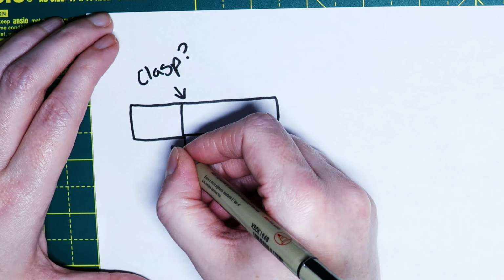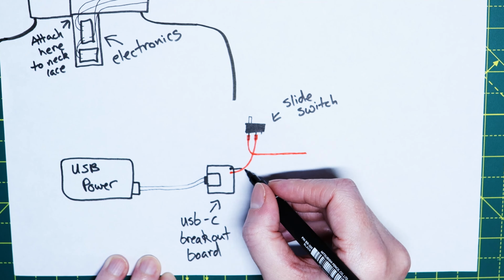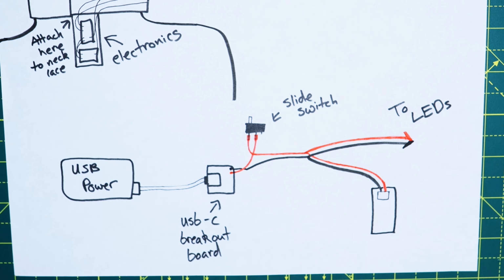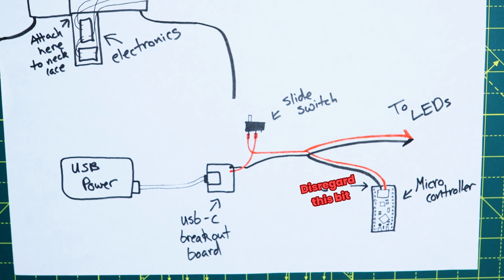I planned to put the microcontroller for the LEDs at the back of the neck, as well as the power source to keep the visuals nice and tidy. I calculated based on personal measurements that I would be using at least 1 meter of 144 density LEDs, and I wanted to make sure that they were powered consistently and safely. I opted for a small USB power bank and split the power from the source to feed separately into the microcontroller and the LEDs. Throw in a switch to add extra control over the system, and we're sitting pretty.